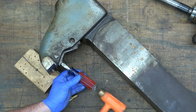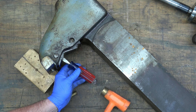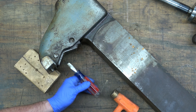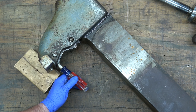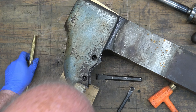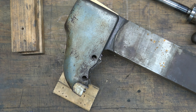The pipe jaw inserts actually have a little bit of play on each side of them, about an eighth of an inch. If they're not perfectly level, those pins don't want to drive out of them very well. There's nothing else holding the pins in there but friction, but I'm using a brass punch and my brass tip hammer and I'm just driving those pins.